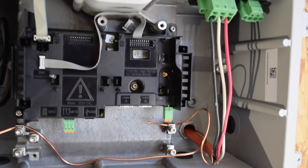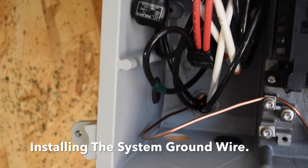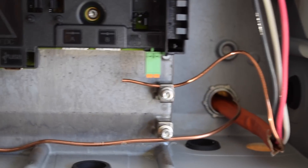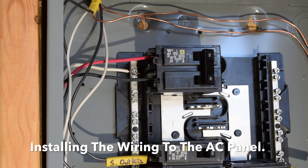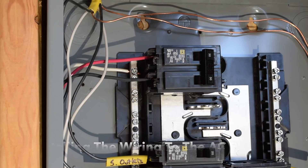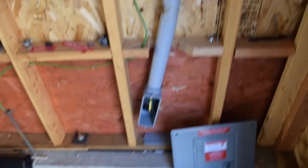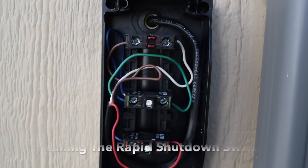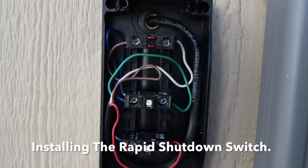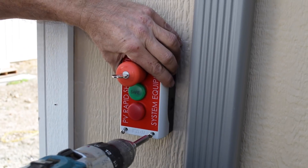The AC wires go out of their terminals with a 10-3 wire and run to the electric panel. The ground wire enters the inverter with the DC wires and attaches to the ground terminals, then continues out of the inverter with the AC wires to the AC panel and attaches to the ground bar. In the AC panel, we installed a two-pole, 30-amp breaker and ran the 10-3 wire from the inverter to it. The neutral wire we attached to the neutral bar and the ground wire to the ground bar. From this AC subpanel, the wires run to our main panel that holds the electric meter. The rapid shutdown switch was installed on the outside of the shed so it could be accessed without going inside, and the control wires were attached per the manufacturer's instructions.